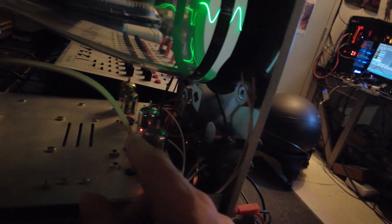These two tubes here produce the deflection voltage, and they're the output of these two tubes over this twin lead, so the signal comes in here, gets amplified by the first stage, goes down the twin lead, gets amplified by the second stage, and deflects the beam to create the pattern.